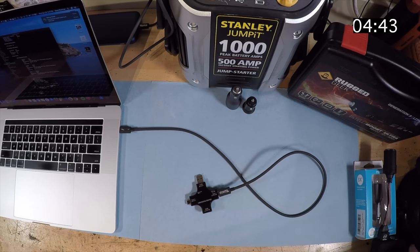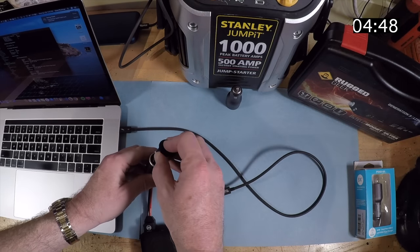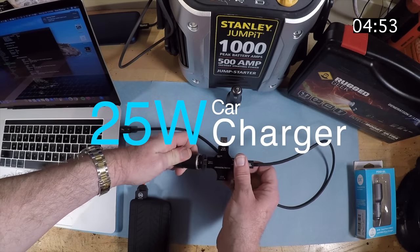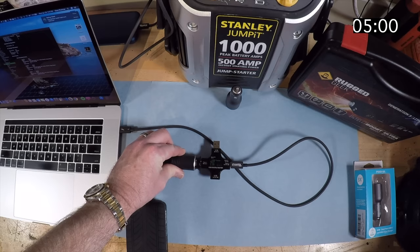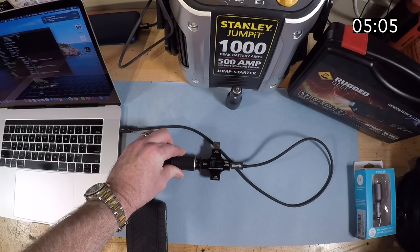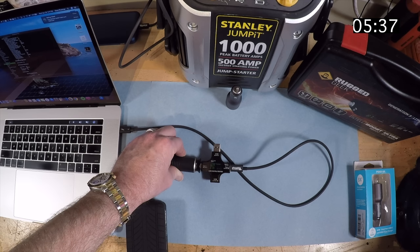Part of the beauty of these USB-C packs is that they're bi-directional, so you can charge them through the USB-C port as well - in this case it takes 37 watts, way faster than your standard 5, 10, or even 24 watts. If you want to charge in your car, here's the 25 watt unit - kind of flushed and hidden with a light. USB-C, plug that in - it cranks up to about 10 volts and about 2.5 amps, giving you your 25 watts, and it doesn't seem to heat up too bad. The Mac reads it in the 30 watt class, which sounds about right. This is fine for recharging your Mac when it's sitting there but not for actively using it.